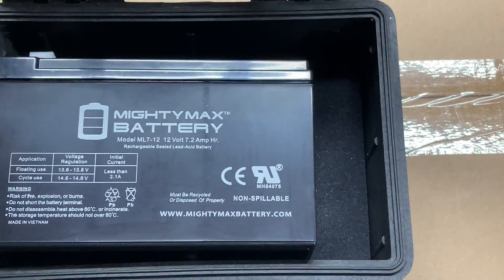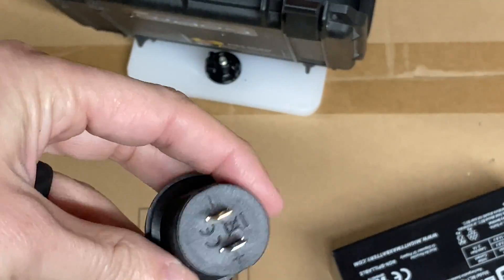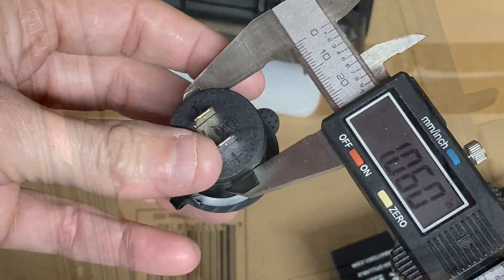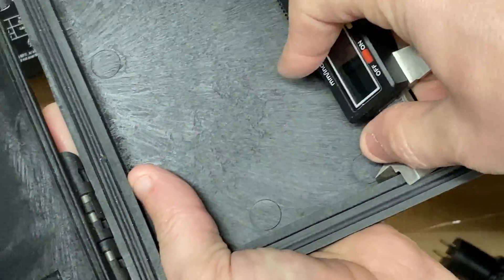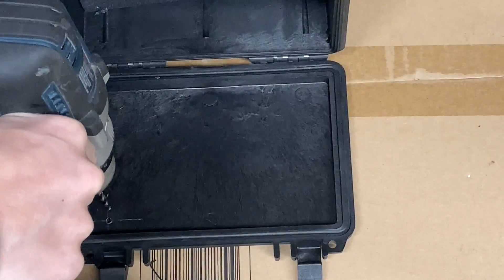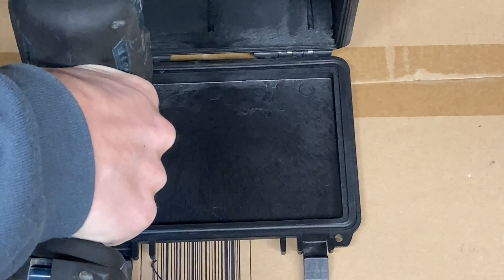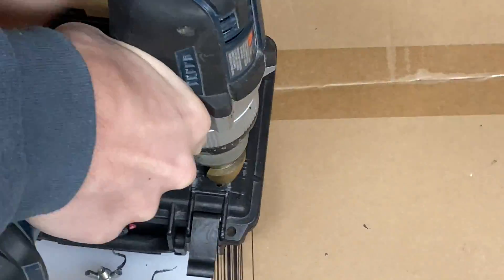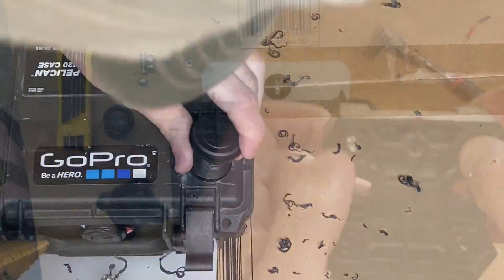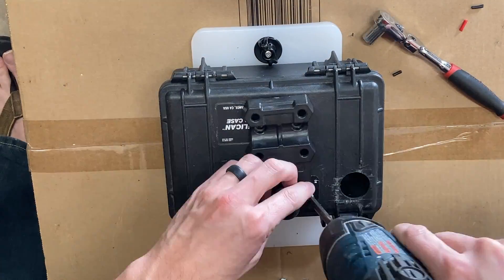This is the battery I'm using — a 12-volt, 7-amp-hour battery — and this is the 12-volt USB charger. I measure the circumference and set my calipers to half that so I can score a line, which will serve as where I need to drill. I actually drill a little bit higher than the first hole because I want more clearance so I can shut the box. I believe this is a 1-1/4-inch hole that I'm drilling here. With the hole drilled, you can start setting up the Yak Attack switchblade and mount the plate.